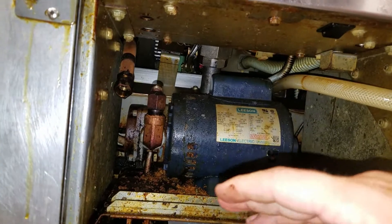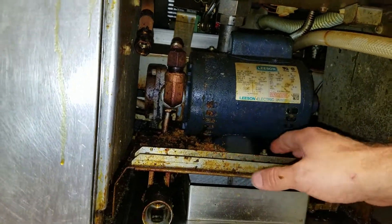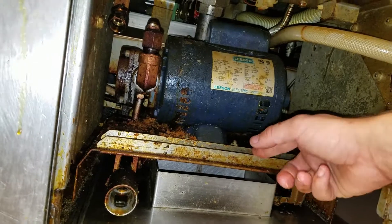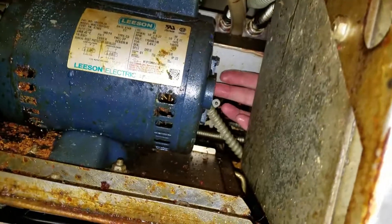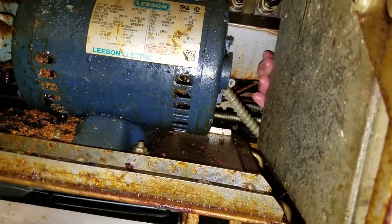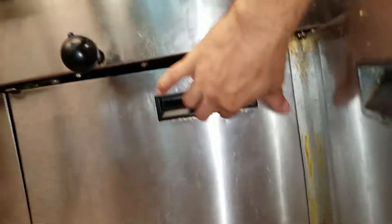I'm going to take out the motor now. To even check the head of the pump you can't just take it out - right here these little boxes are in the way, and that's where your ignition control modules are for each vat. There are a couple of 7/16 nuts and bolts right here and one on the very back side you've got to take off. Then you've got to reach in through this side door, remove this jug of oil, undo back here to get access to where the wires are, undo the screws here and here, then you can get access to the wires and conduit and take this whole thing out. There's also another hose in the back - to get to that you have to go to this door, reach underneath, and get to that coupling fitting right up there.